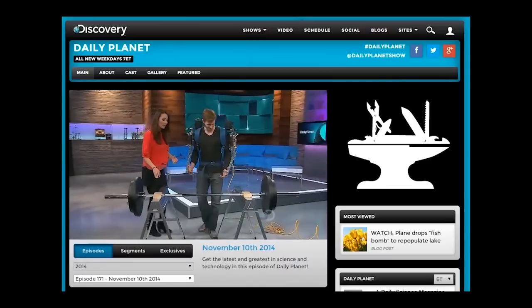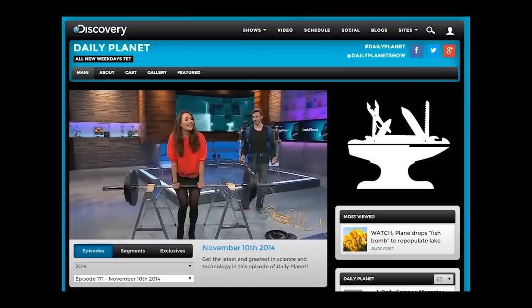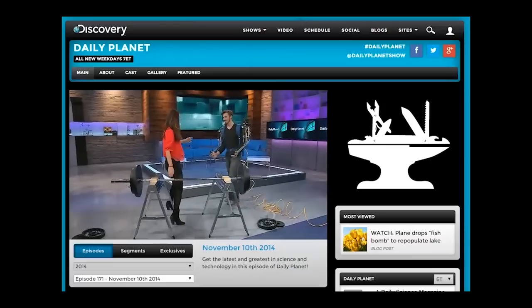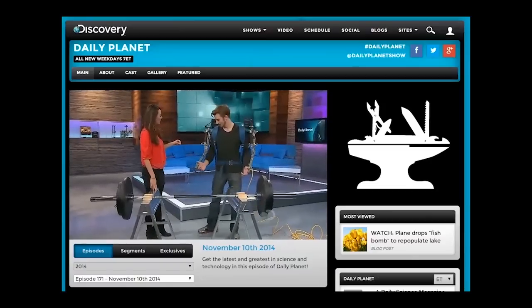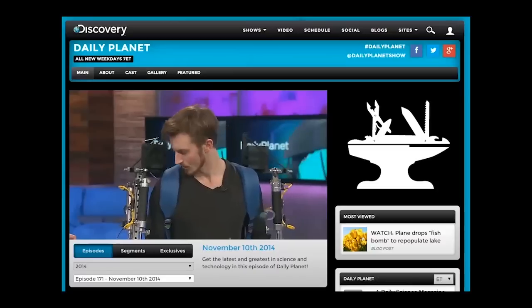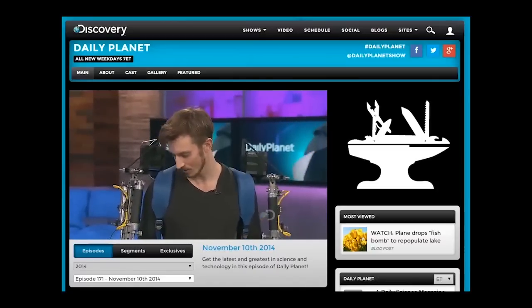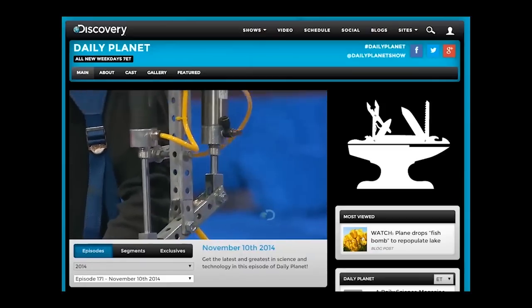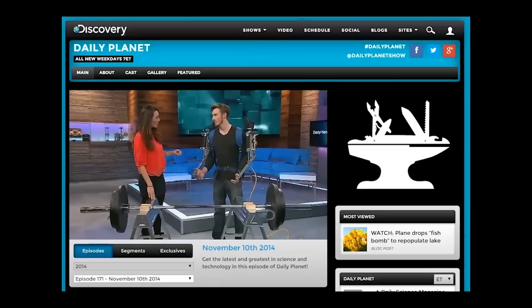I want to show everybody at home — we weren't kidding. This 205 pounds right now, I can't even lift it at all. So how did you build this system, this exosuit? Basically, I picked up the metal and started playing around with the basic linkage for the elbow. Originally I just had one cylinder, and then I figured I could probably throw another one on there, so that doubled the strength. And the other fun thing is we're running at half pressure right now. It means we could pick up twice the weight, hypothetically, if we had a more powerful compressor.